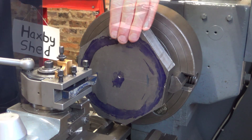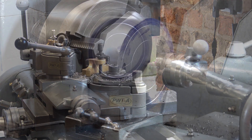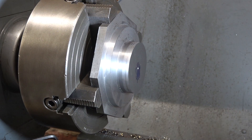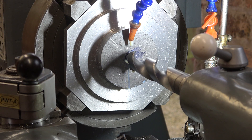I've used the centre point to make sure the work is pretty much centred, and the dial gauge to make sure it's approximately flat — which it approximately is. I'm going to make this the back; there'll be a big boss here to take this bearing. That's hacked it down to round — you can see I've put the centre in, but it's just a fail-safe. That's this side roughed out. I need to make the hole in the centre for the bearing. Now I'm going to go through with this inch and 1/32nd drill, which is the largest drill I've got — Morse Taper 3. This is also one I sharpened on the large drill grinding jig, and this is the first time I've used it since then.